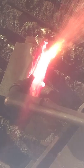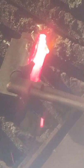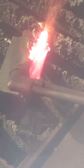I'm coming up on that back weld, so I've got to be careful here not to cut through it and into the bottom plate. Now I'm back up where I sit there. Let's get it going. I'm also angling it toward the outside. That way I have very little cleanup. Alright, there's one side. Go back and get this side.